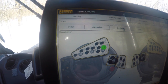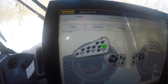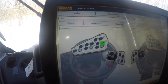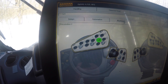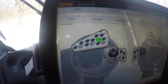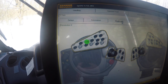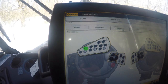My left hand first row down is my pre-selection buttons. Pre-selection one cuts to 8'4" — no matter what I'm on, it'll slide the harvester head saw to 8'4". My second pre-selection button is 10'4", then 12'4", and then I believe I go to 16s and 18s.